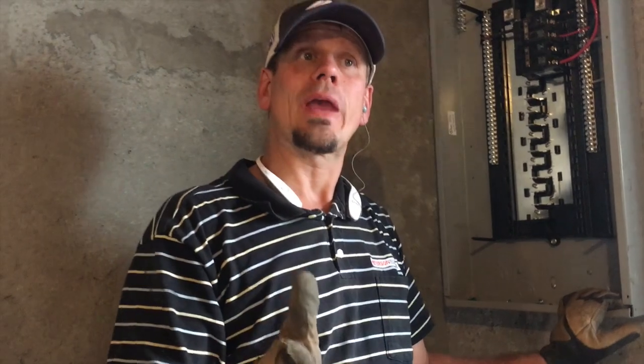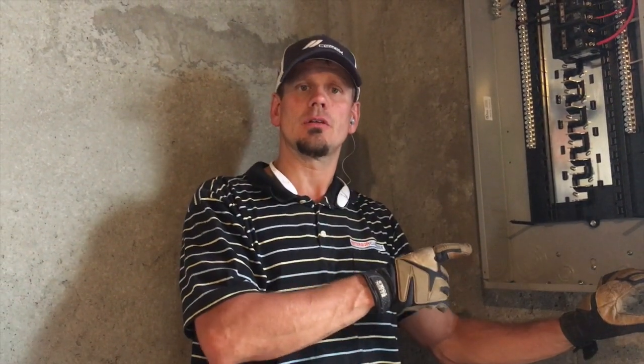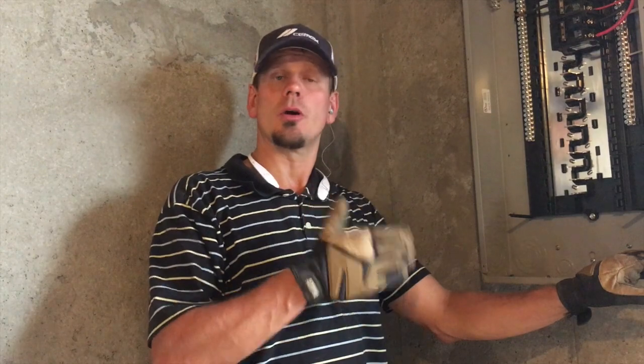Some people have asked if it's okay to step from 100 to 100 to another 50. Technically you're really supposed to step it down — if it's 100 amps outside, feed it at 60, then at 50, unless you're running all those heavy loads mentioned earlier. If you have 125 or 150 amp service, you don't need 200 outside — you can step it down to 100 here. The major thing is making sure the bus bar is rated for that. On his panel, the sticker was gone after 20 years, and once that sticker is gone it becomes a common-sense call that the inspector will look at.